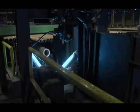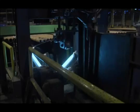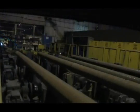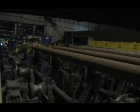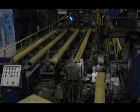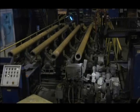As tubes travel through the ship preparation line, they are automatically gauged and measured. Cameras optically measure the OD size, while other techniques are used to ensure that the tube is the correct length as specified by the customer. The grade is verified with an inline spectrometer. Each tube is identified and marked with a unique customer order number that's stenciled on.